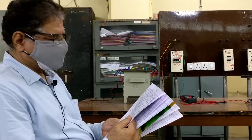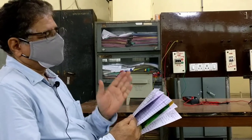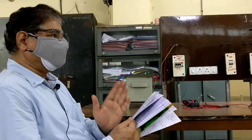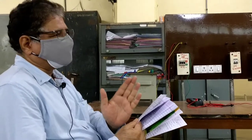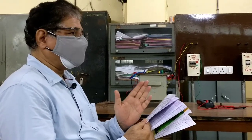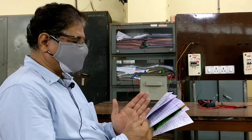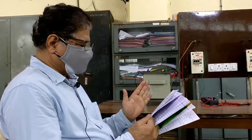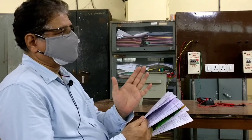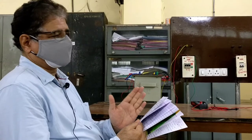For our transformer, the HV side voltage is 440 volts and the LV side is 220 volts. To measure the voltage ratio, we will supply the LV-side 220 volts as input to the HV-side winding, and correspondingly measure whatever voltage is induced and available at the LV terminals. This is regular practice as per IS standard 2026, to be performed on all power transformers and distribution transformers of all types. This is not our traditional laboratory experiment where we give full voltage to the primary and measure the secondary — we are performing the voltage ratio test as per IS 2026 test method.